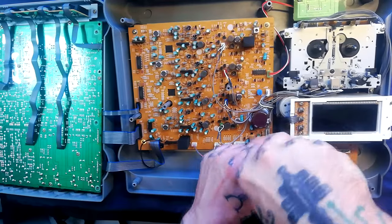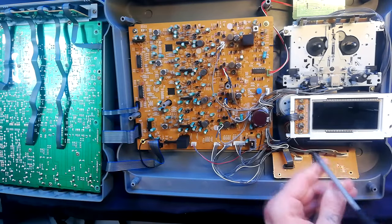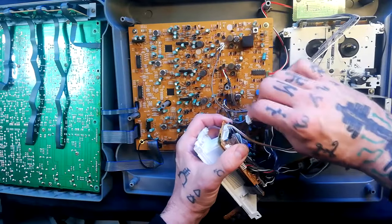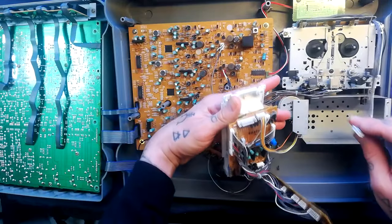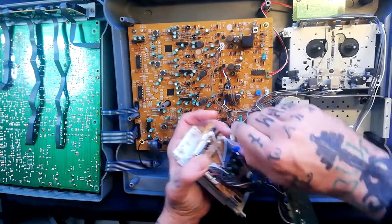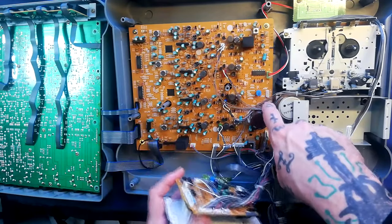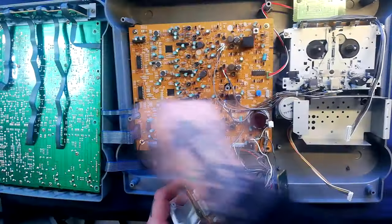There's a metal cable tidy with another screw here — those are the kind of screws going into plastic mounting posts. There are four screws visible holding this down. Two from one side are the same as the kind we removed from this board, and two from the other side have a double dome top. I may be able to disconnect the wires going to the transport from the header marked P902, and then the connections to the motor beside it at P901. I can't see the number for this connector, but beside this blue component and what I assumed were track numbers are actually socket numbers — so this is number seven that I'm disconnecting.